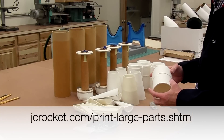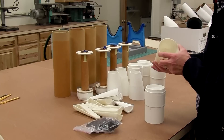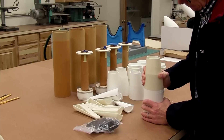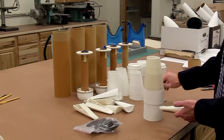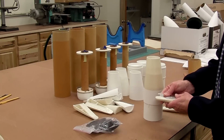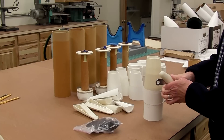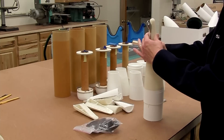Mechanically, the most interesting is the forward end, made of four pieces. We have the base, the midsection which I've notched, and the nose tip, which is made in two pieces so that the aluminum forward bracket can insert between them. This also keys into the midsection to keep everything in alignment.